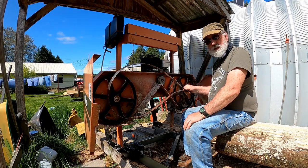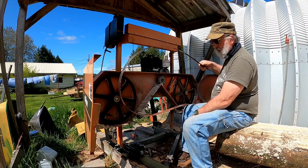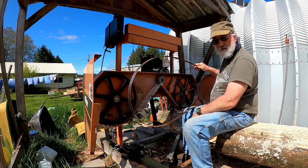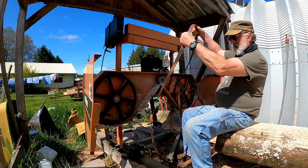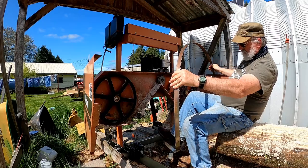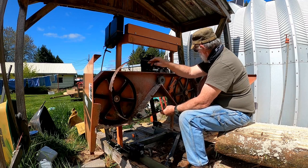Well here's a pro tip for you. I had to go get another blade out of the pack of blades. If you just throw it on the way it unwound, look at the teeth — the teeth have to be going that way. This blade is backwards. I can't turn it upside down because the cutting edge is on the wrong side. So what do you do? How about you turn your blade inside out — being very careful that the bear trap doesn't catch you, because these are sharp. There, now we got it going the right way. You can use that trick on your band saw when it isn't cutting very well either — you just may have it inside out.